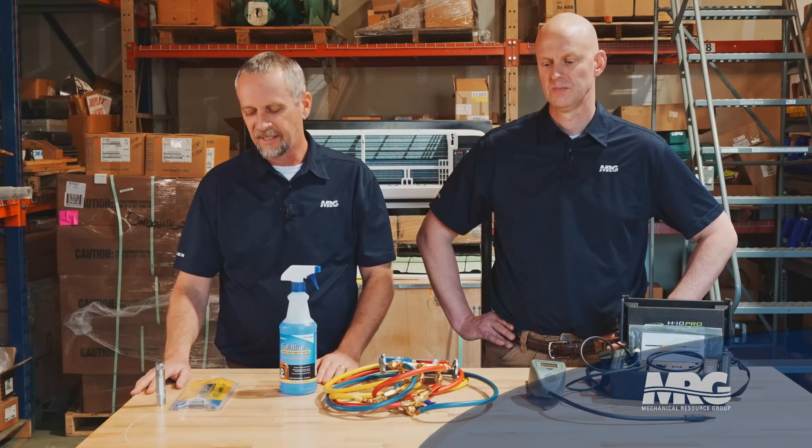Maybe you've got a 30-year-old unit and the customer just wants the cheapest possible fix — maybe you can try it there. It is something that's been on the market for a long time, and people have had success finding leaks with it, but there are downsides. Don't put too much dye in the circuit, and there's a cleanup afterward to get it back out — you're supposed to blow it out with nitrogen, and sometimes that doesn't happen. Not a great way to do it, but worth knowing it's out there.